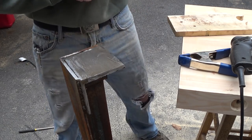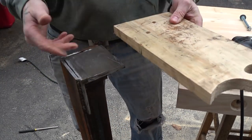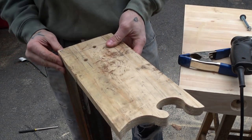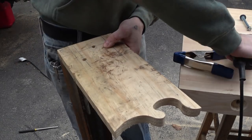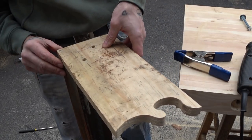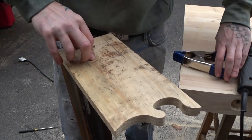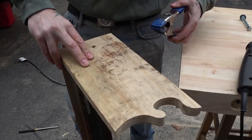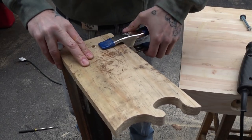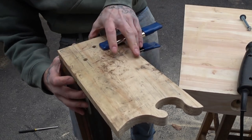Here's how we drew up a little template. There was all types of Uncle Jerry math involved, but we figured out exactly where we want to put the two holes. But here's the thing, I can't just drill obviously a 3/8 inch hole straight through the metal. You got to start with like a 1/8 of an inch and work your way up. So this is what we're doing. We're clamping this template in place. This has already worked 3 times, so I mean it's not the most amateur hour thing I've done.